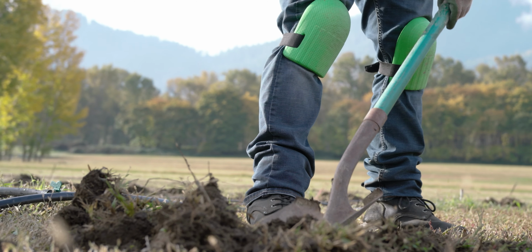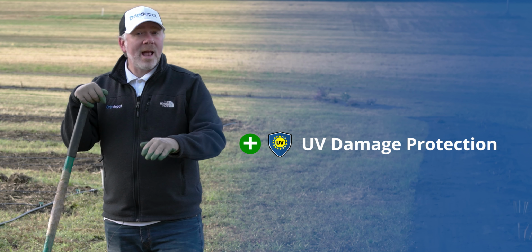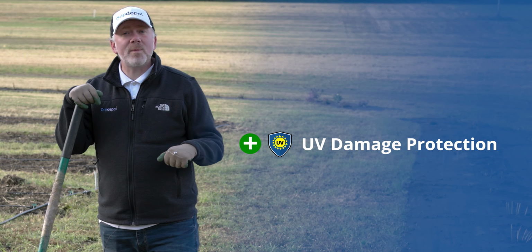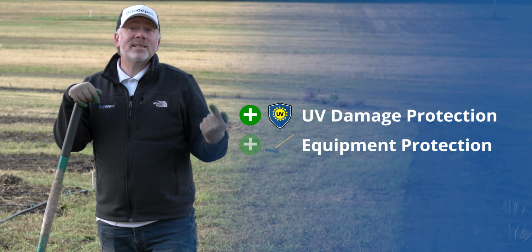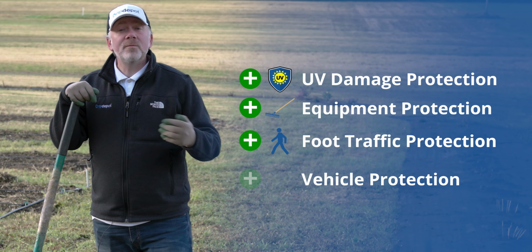On the pro side, burying your tubing protects it from UV exposure. Poly tubing is UV treated, so it can be left on the surface, but burying it out of any UV exposure can extend its lifespan. This also protects it from landscape maintenance equipment, foot traffic, or, depending on where it's installed, even some vehicle traffic.